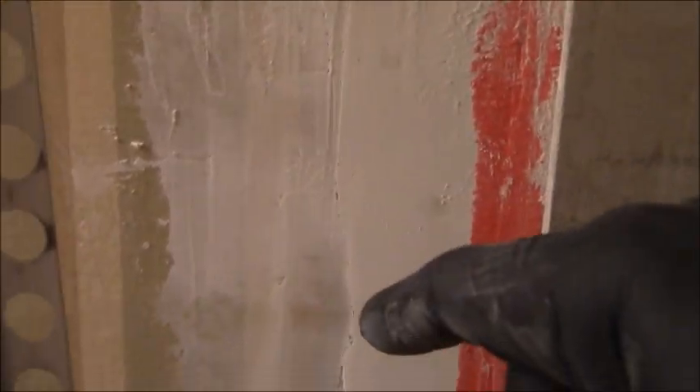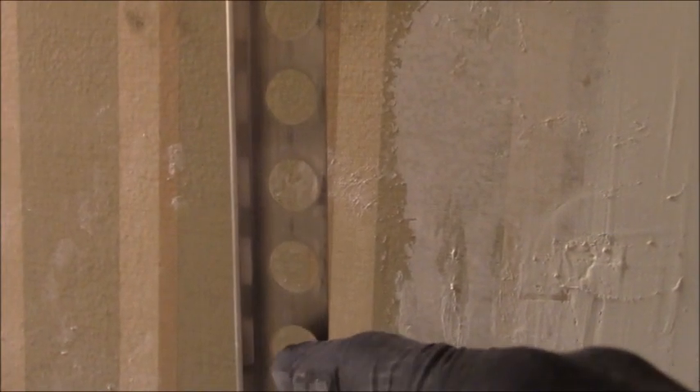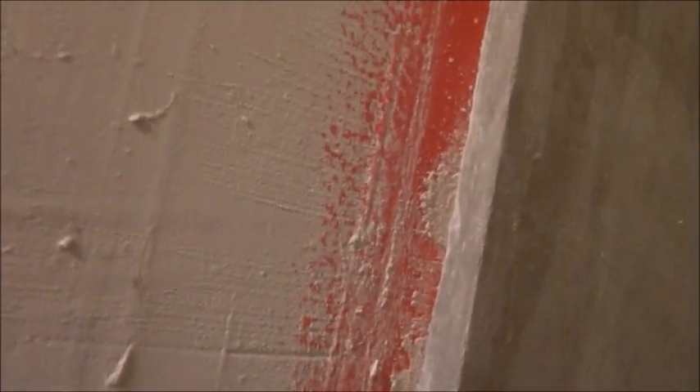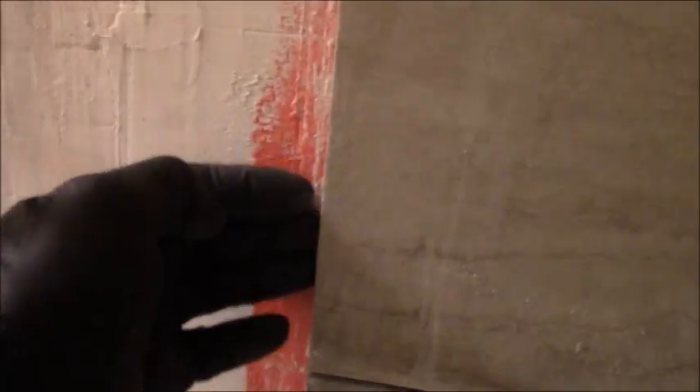The easiest thing I've learned — I've never stuck these to the wall, it just kind of made sense — is that when you trowel out your thinset and back-butter your tile, you leave a gap of about an inch. By the time it gets up to the edge of the transition it's about three-quarters to five-eighths of an inch, so I leave about an inch to an inch and a quarter void. I keep a sample strip in my toolbox and slide it in there to make sure there's no thinset.